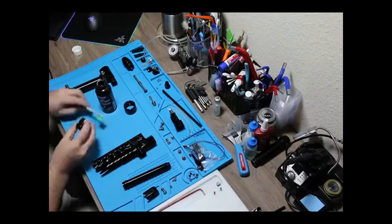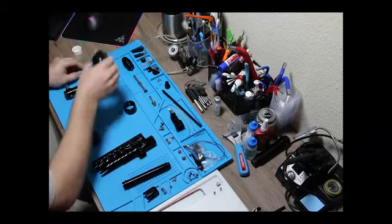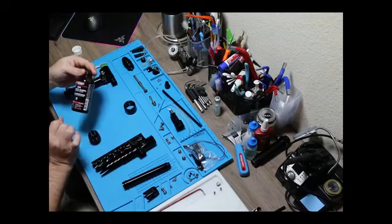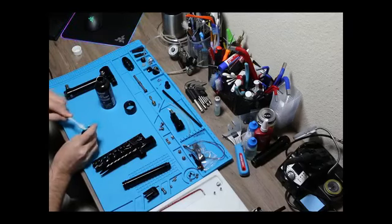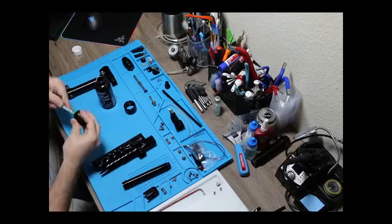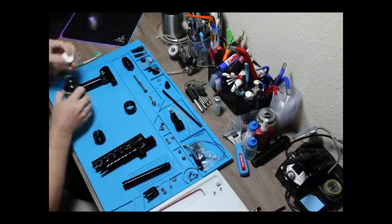Right now what I'm doing is trying to get all this old packing glue and dust out of these little crevices before I start. Also, if anybody bought any of this, buy this right here, isopropyl alcohol. You want the 99.9% pure. It works for electronics, but it also cleans paintball gear well, and you can clean paint off your micro switches or your boards. I like to use these soft toothbrushes. All right, I think that's as clean as I'm going to get it.